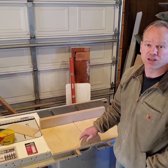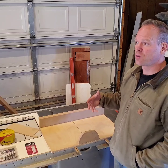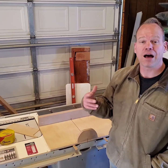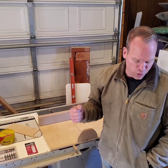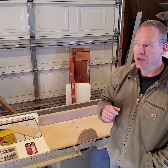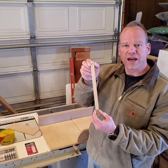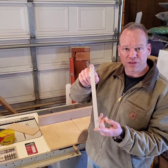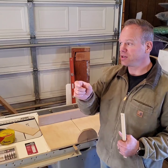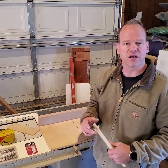After getting it put together, I needed to square it. There is a five-cut method out there that is very effective for getting that square. As I was going back to find one of the many YouTube videos showing how to do that, I scrolled past and looked for a calculator instead. What I found was windridgewoodcrafts.com, which has a calculator. I'll put a link in the description. You put in the width at the top and bottom of the last cut, the length of the cut piece, and the pivot length between your two screws. You hit enter and it gives you a number — 0.00 whatever — representing how far you need to move it, and whether to move it forward or back based on positive or negative.